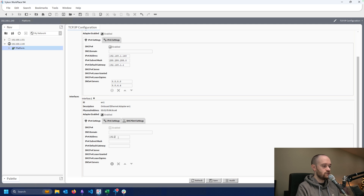First, make sure the adapter is enabled, then set an IP address for the JACE itself on that secondary port — the DHCP server doesn't give itself an address, so we set it manually. I'm using 192.168.111.1 with the standard subnet mask. The gateway and DNS servers aren't strictly necessary since this port is only for a side trunk of devices, but we'll fill them in. Note that the subnet here must be different from the subnet on your primary port.